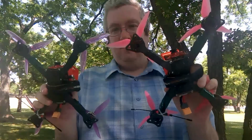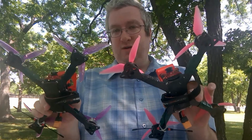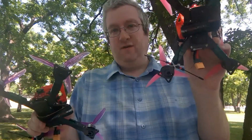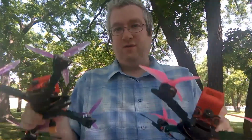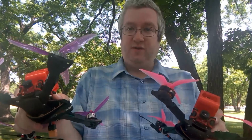My friend Brian says I should explain to you, whoever you are, why I'm running the setups that I'm running. Got two of these quadcopters that I built in December and January. They're Owl RC Dragon frames with F40 Pro V2s 2600 kV and ZMX 2207 2600 kV motors.